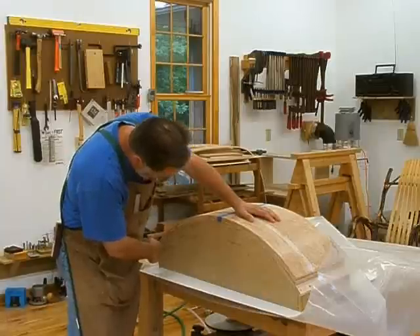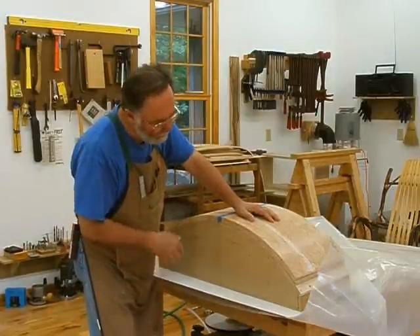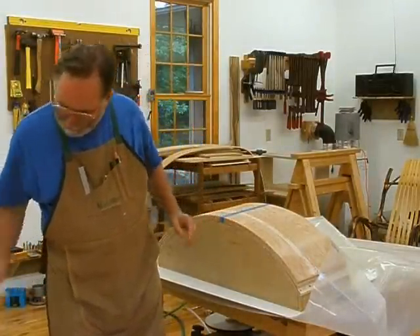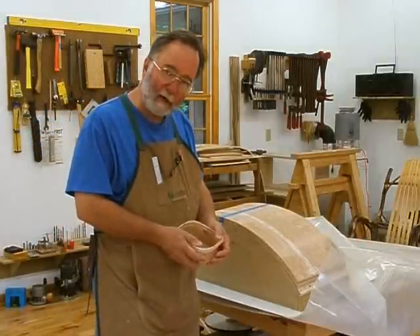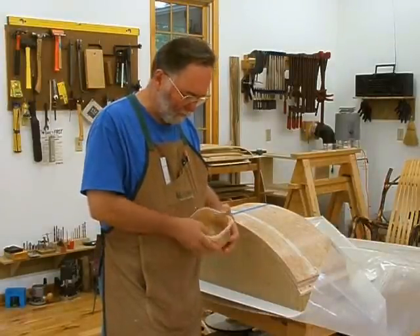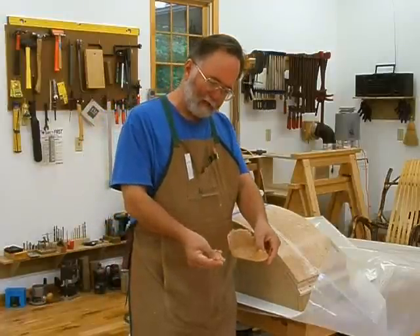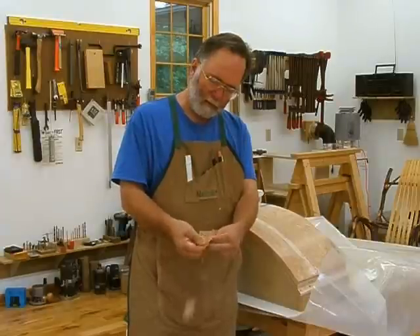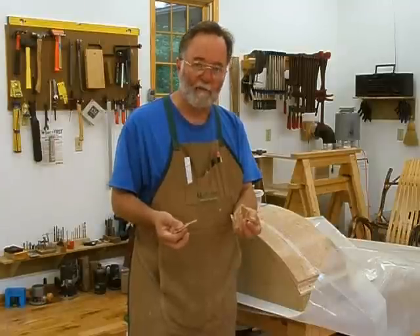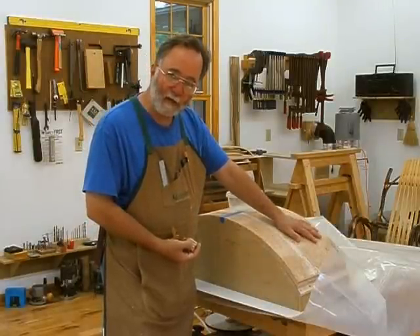You might notice there's a little bit of gap between the form and the finished laminate — that's called spring back. There's always a little bit, so it's just something you have to account for in the design; it's usually not very severe. I also wanted to show you what this Unibond 800 glue looks like when it's finally dry. It doesn't stick to the plastic container, but it makes a very brittle glue — like peanut brittle — and that way it doesn't creep. In the next episode we're going to go ahead and veneer this with the finished veneer, and we'll see you then.